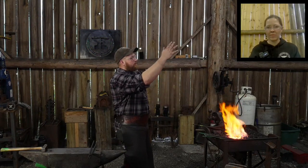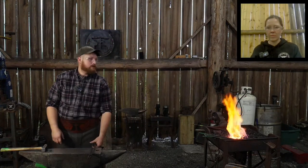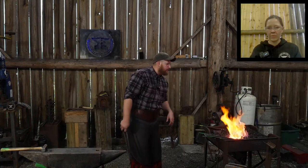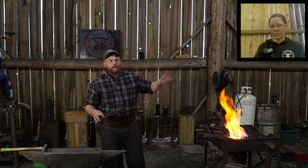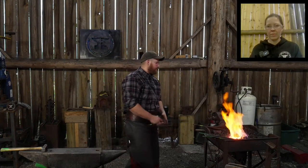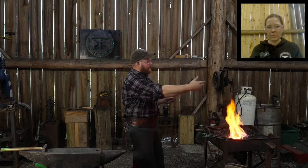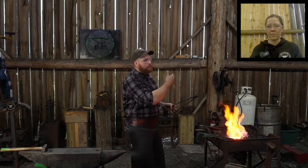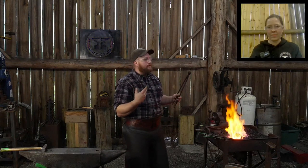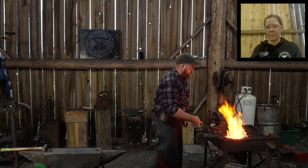And then I will have a large hood above it. And that hood will be powered. So it'll be a powered exhaust hood to pull out anything and blow it out the top. So it'll be able to do both. It'll either be powered or it'll just be able to have natural drafting. Generally, when you go with a really open concept like this, in order not to get a whole bunch of smoke rolling out, even if it does draft well, or have a bit of breeze come through and blow the smoke right in your face, you've got to have a powered draft right above it that can overcome that stiff wind, if you will. So.